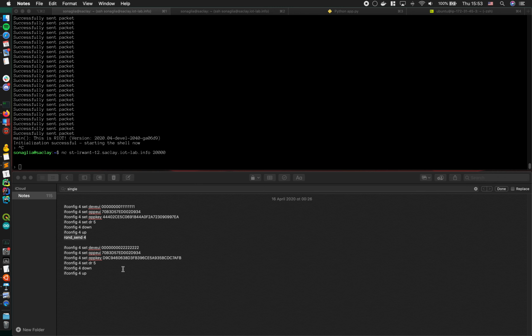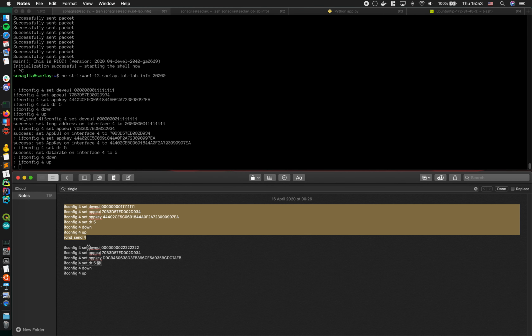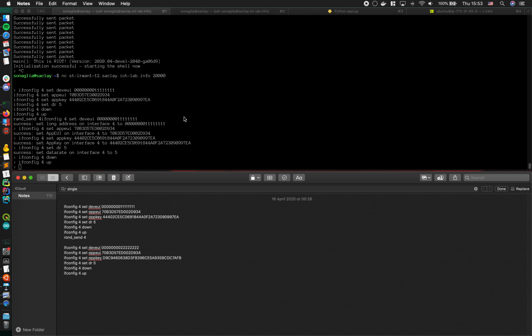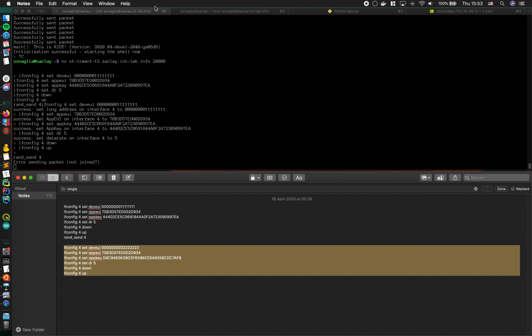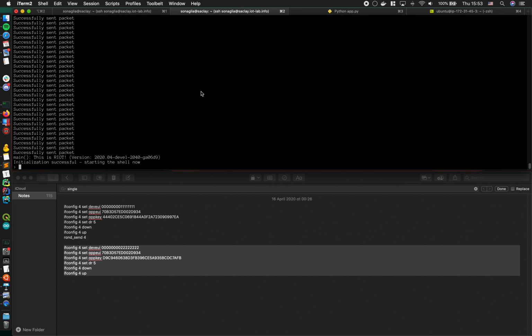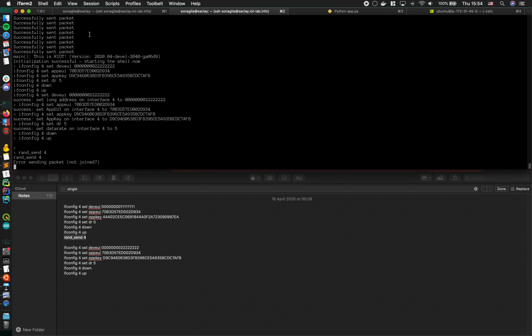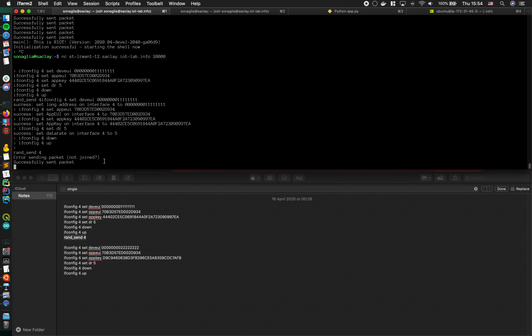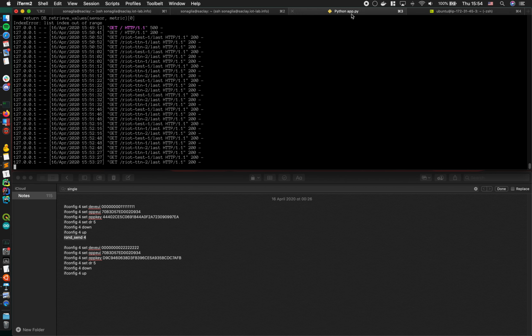nodes that are running on IoT Lab, and I'm going to pass the configuration in order to set up LoRaWAN, and then this command, run send, will send random measurements in order to check that everything is working properly. So I'm doing it on both the nodes. It says not joined because the first messages are sent too early, but it is actually working.